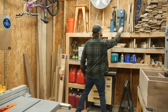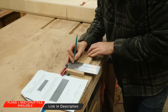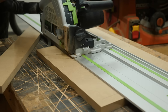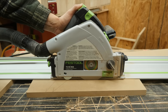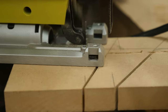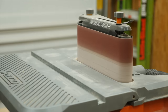With the rough leg shape made, I needed to make a template to get the final shape. I grabbed some scrap MDF and sketched out the leg shape from the drawing in the plans. I could then cut all the straight lines with the track saw and later cut all the curves with the jigsaw. It'll probably leave the template pretty messy, so I had to do some quick cleanup to sand the template smooth.